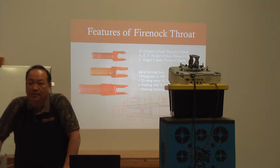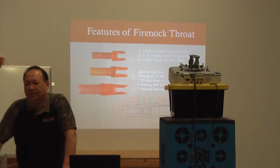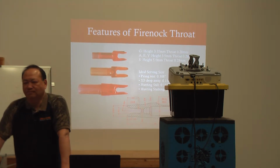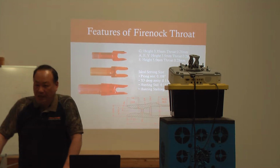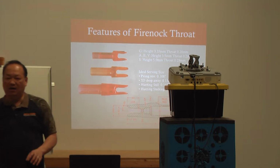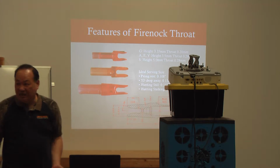They're different. But then, how can we possibly guarantee all the nocks are exactly the same size? Even with the current CNC technology at 0.25 thousandths, you cannot guarantee it. Now, as the flow of the polycarbonate changes, that means the density of the flow changes, the curing of the flow changes, and the rolling of the polycarbonate changes. So that's the reason you find out, a lot of times when you got a good batch of nocks, from most of the companies we use 4, 6, 8 cavities, some nocks work better than others.